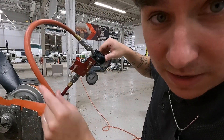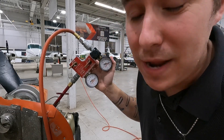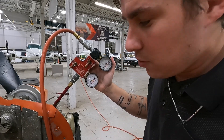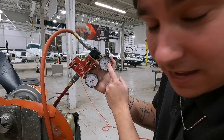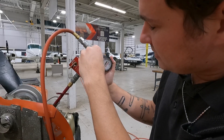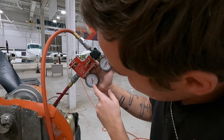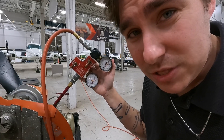Fun fact: if you're doing this with the DME, you can ask him to help hold the propeller. But you need to tell him exactly what to do — do not assume he'll know. Give him very clear instructions on holding the propeller with two hands and not to move it. I'm going to flip to the side so I'm clear of the propeller arc. I've got about 30 PSI on this gauge and about 22 on this gauge, and I'm slowly going up to 80 PSI. The piston is perfectly on top dead center so it doesn't want to move. I'm reading 80 PSI on my left gauge and about 64 to 66 on my right gauge — actually really good for an engine that hasn't been running.